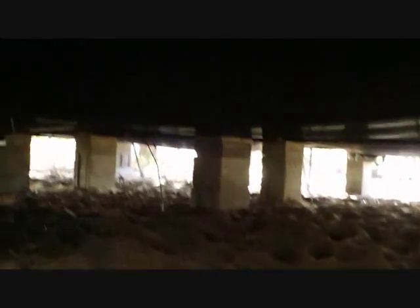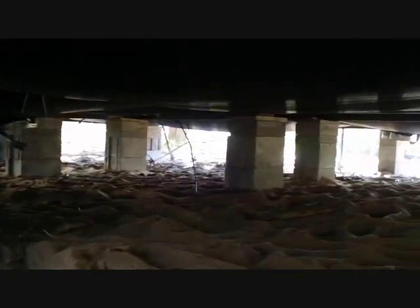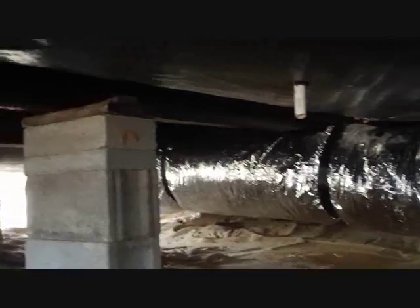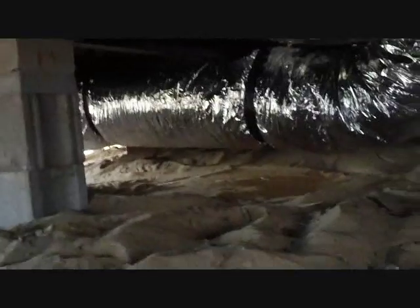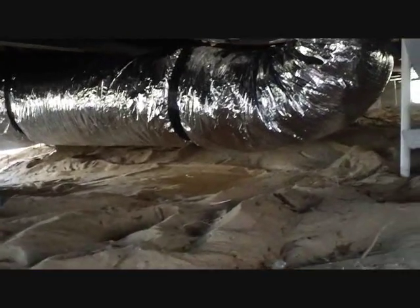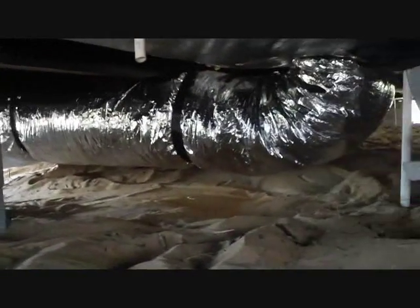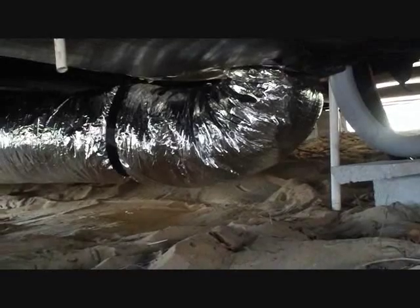My next step — all these double-wides have crossover ducts. We had to connect the new 12-inch flex to the crossover duct because the old flex were left outside. We're going to do that, and we probably had to do a little digging too to get enough clearance. There are our crossover ducts — had to dig out from underneath, especially where it turns up and goes into the floor. The code requirement is 4 inches; I've got about 5 or 6 inches under most of it. Where else can you be the company owner and dig underneath the ducts, just like you did on the first day of work?